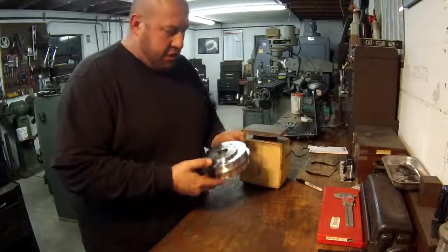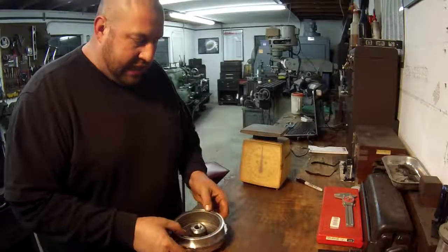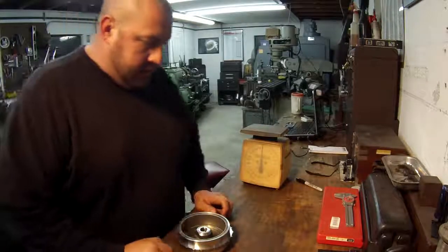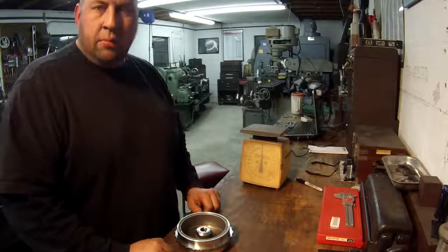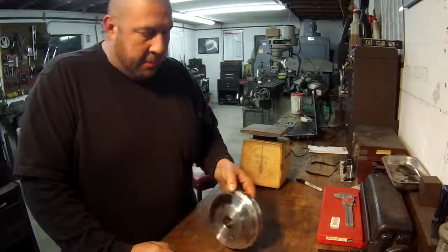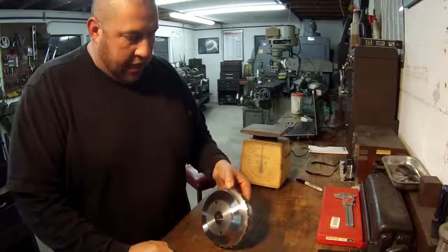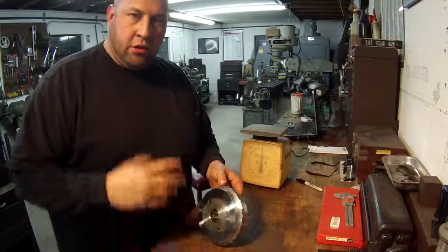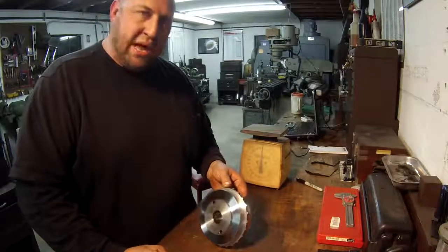So that's a significant amount of metal come off these flywheels. And from what I understand, them guys like that because it just helps that motor wrap up a little faster. It's a performance thing, you know. The guys are always looking for a way to get a little bit of power out of their bikes. And this is actually a mod that the mechanics there at the bike shop do. And I believe this is a thing that they sell the customers for their bikes whenever they're in there doing some mods to try to trick the bikes out. They sell them a new flywheel that's lightened.